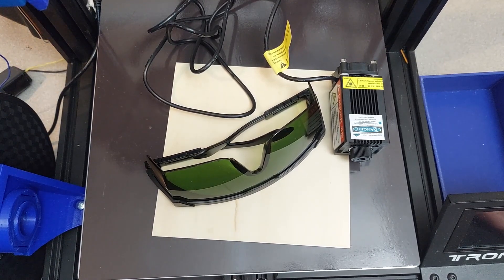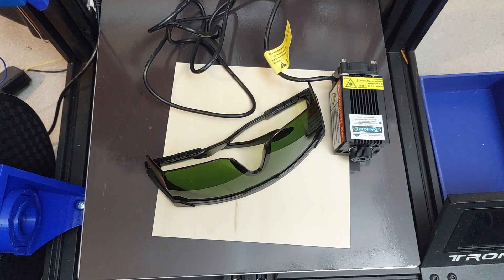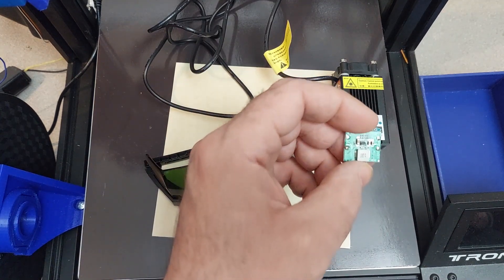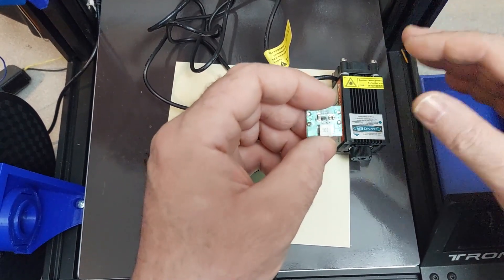What I had to do was put a buck converter in myself. I used a method from Michael at Teaching Tech, who did a video on lasers about a year ago showing how to wire a buck converter properly. It maximizes output, though the capacitors in there will slow it down a little bit, but you can still use it properly. Just make sure you check your polarities — that was my mistake.